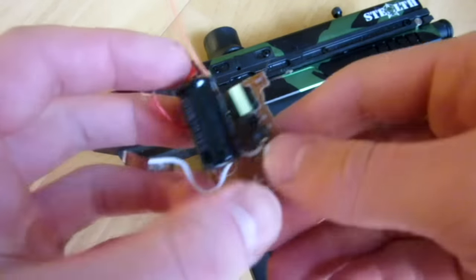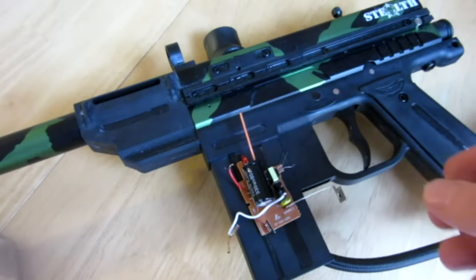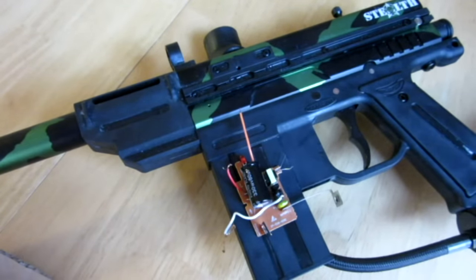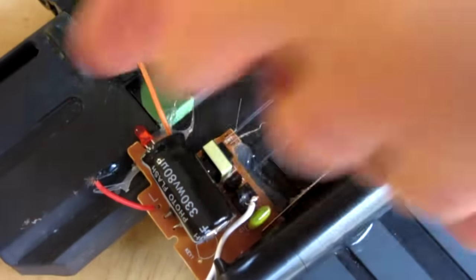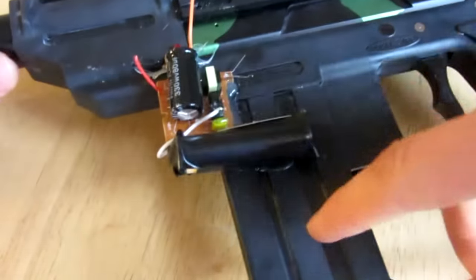Now you are going to want to mount the circuit board in a convenient location on your gun. I am using a paintball gun and mine has a little plastic magazine right here, so I am going to use a bit of hot glue and attach it there with the battery in a location that works very nicely. One thing I forgot to mention — which is why I have offset it — is that the charging button is on the other side of the circuit board. It is that silver button right there, and obviously you have to be able to access it, so I cannot simply put it right on top of my magazine.